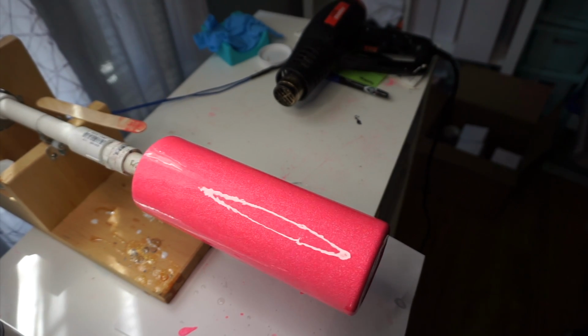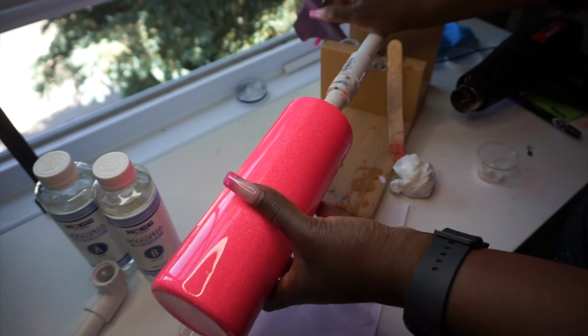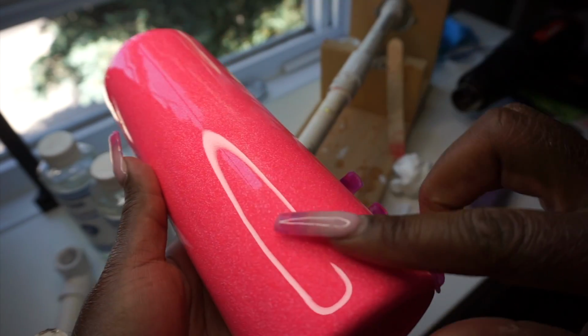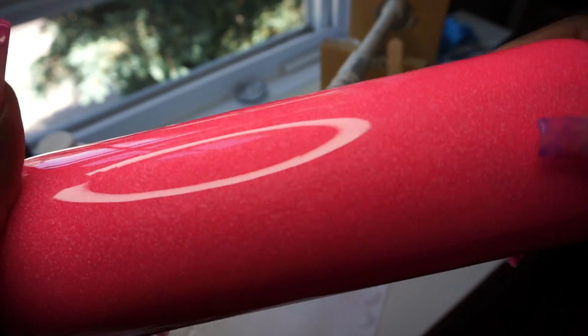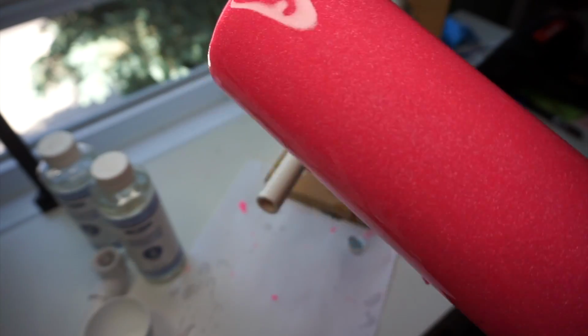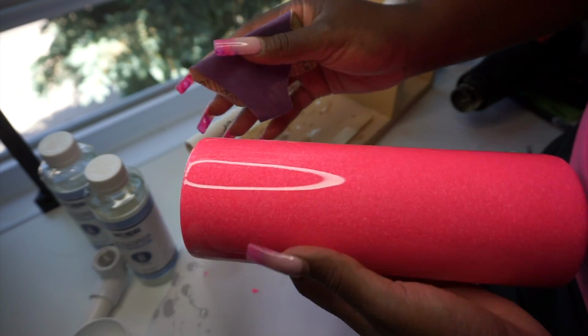We're going to let this sit. This epoxy that I'm using has a 4-hour cure to touch time. The full cure time is 72 hours. And so you can see the little bumps and the little valleys and stuff. That happens. That's why I say bottoms are difficult. You see all the texture on the bottom. That always happens.